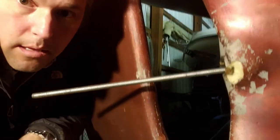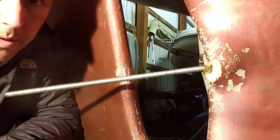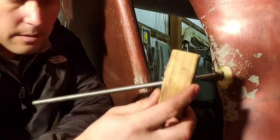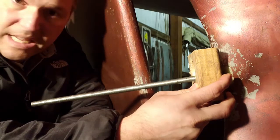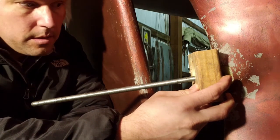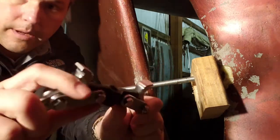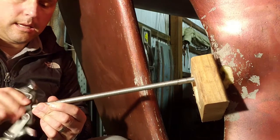So this is my fourth attempt — well, fourth day really — working on this. This is the part that chipped off when I was trying to collapse the interior portion of the cutlass bearing. What I've done is create these blocks, which are two inches — they'll slide right over the rod here — which will give it enough room or clearance for the bearing to slide out as I'm pushing against it. On the other side is a nut holding in a washer that slides into the sleeve of the stern tube, not the bearing. So it should bring the bearing out as I use the top end of the puller I bought at Harbor Freight, because it's threaded at a half inch, which is what the rod is.